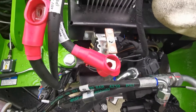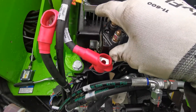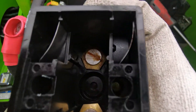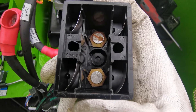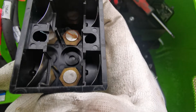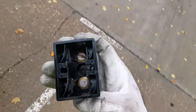Some sort of fly — it's just a bit unlucky and got trapped in between the contact plates. I'm not sure how it got in there. What happens is when you start the machine up, the motor controller does its checks and then tries to pull the contactor in. It pulls it in, but because of that bug sitting on the contact plate, the contactor does not close and the motor controller does not see the power coming through. So that poor bug has caused all the problems for this machine.